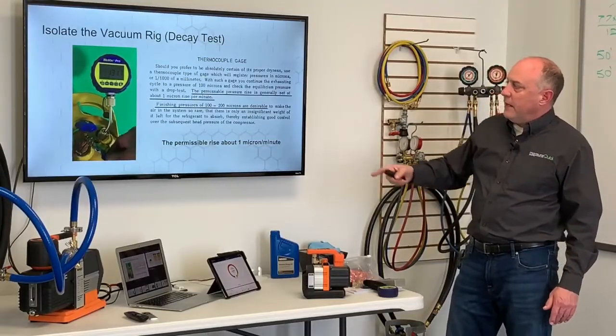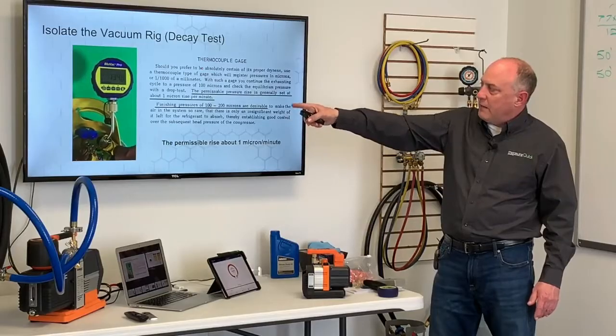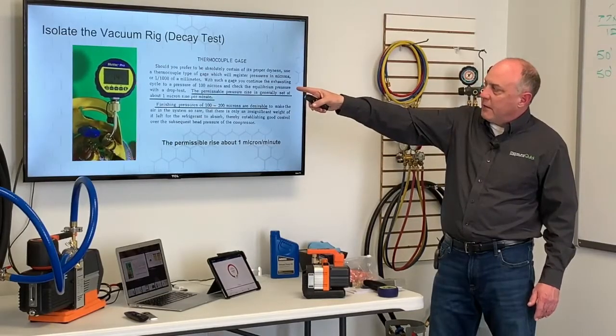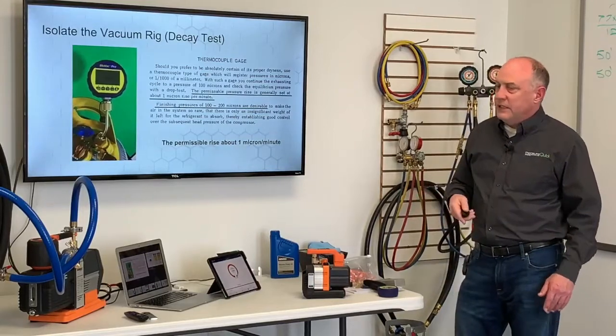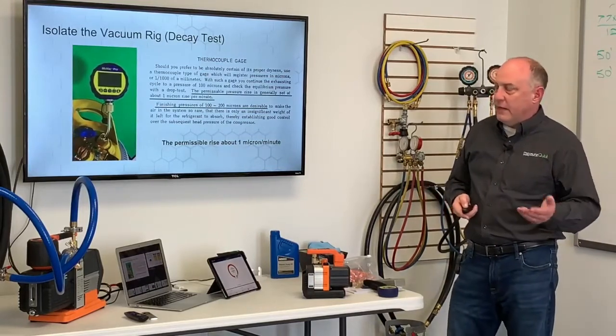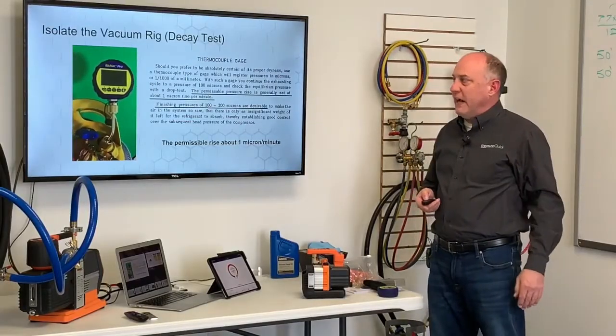I'll click this video here. You can see it, we're opened up. We start closing that valve off down in the bottom. We're at 135. The micron range is rising up to 153, 157, 160. This is a decay rate we're looking at. And eventually that's going to go up very quickly and then it's going to flatten out and we can see what our ultimate vacuum is.